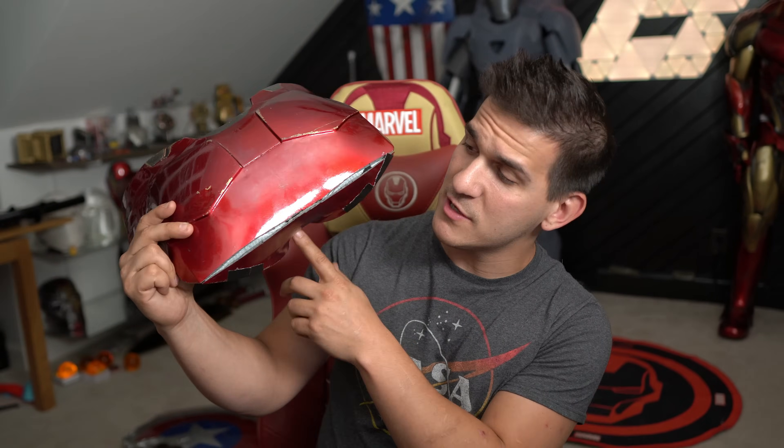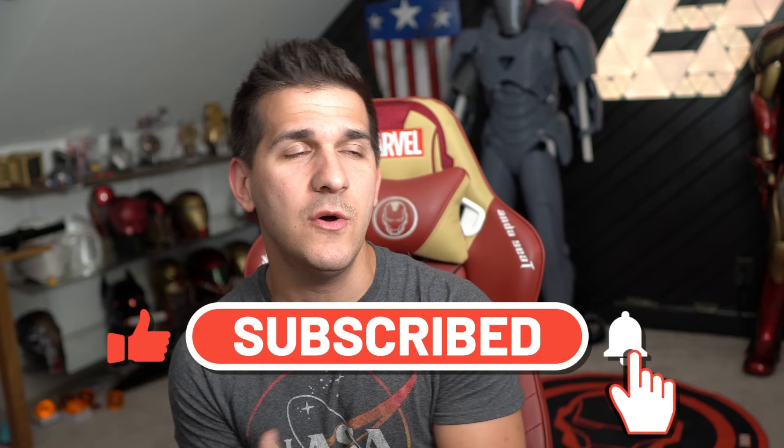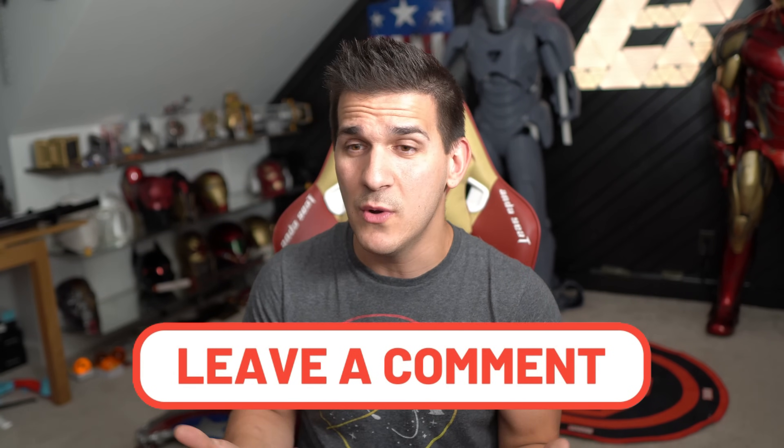I just want to cover a couple of caveats. Obviously, if you're going to be PLA welding something that's already painted, you have to be a little more careful not to punch all the way through the plastic — heat discoloration and warpage can happen, and you can ruin the paint if you're not careful. The butt plate to my Iron Man suit actually broke just the other day, and I'm going to weld it back together — it's already been welded back together quite a few times. I used rafts and PLA welding to make my own mounting points just to make it easier to wear. So just grab a really cheap soldering iron and start saving your wasted filament and even some failed projects, and just start practicing and experimenting. It's going to be so valuable to have this technique under your belt, and I know it's going to help you in the long run. Let me know down below what you're going to be PLA welding, what projects you're working on, or maybe some stuff you've done that I haven't thought of.